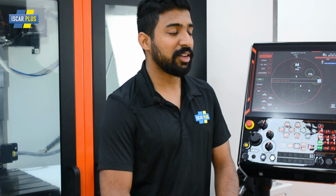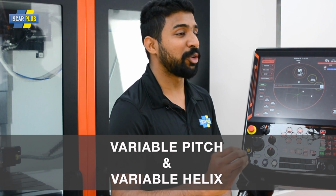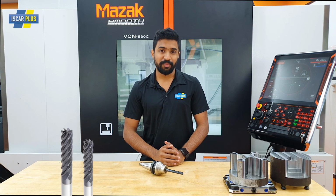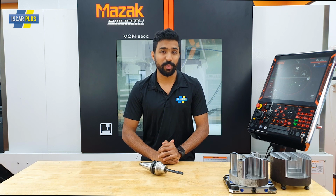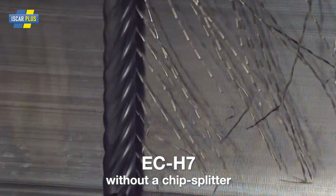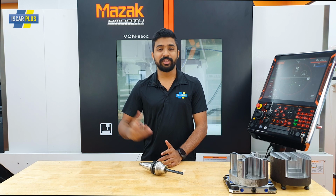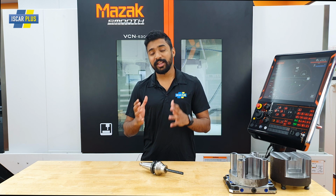This cutter right here features a chip splitter, variable pitch and variable helix, while also having really deep flutes. This is going to give you really short chips that are easy to evacuate. If you look here, you will see an ECH7 without a chip splitter taking a long pass, and you will see how long those chips are. And what that means for you is that there's a lot of heat, there's a lot of contact with the material and the tool,